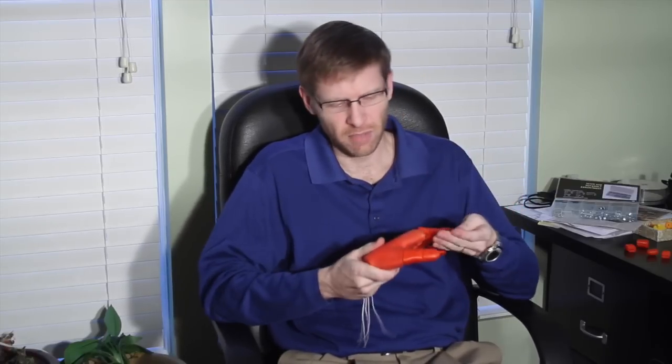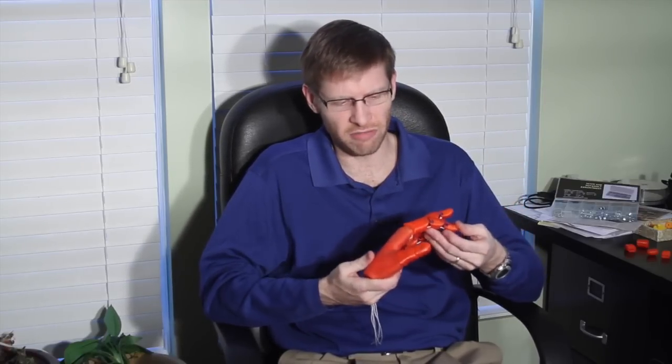You can get a much tighter grip. Really, there's a lot of strength in this, which I think is interesting about the model. One of the advantages I see here is when you look at the design, all of these stress points really seem to be within the hinges. And the hinges themselves are made out of this flexible filament. As much as I've tried, I can't get the stuff to break — it seems to be pretty near unbreakable. That flexibility combined with that strength really seems to work nicely in those joints where all of those tensions are occurring, so this really might have some interesting potential in incorporating this into some of the other designs that are already out there or modifying this one.